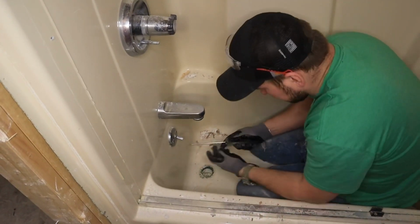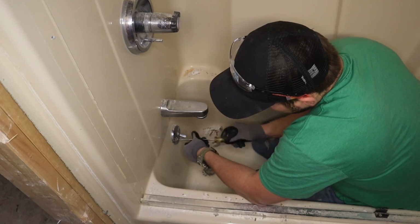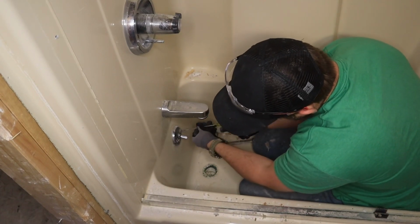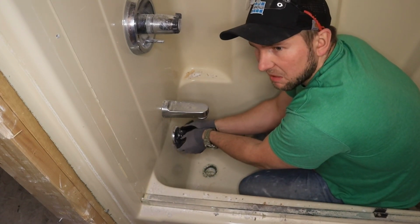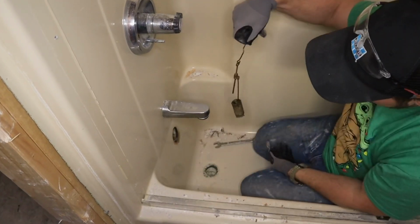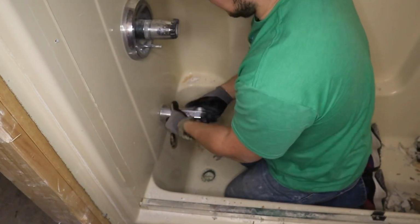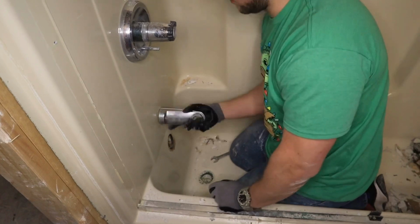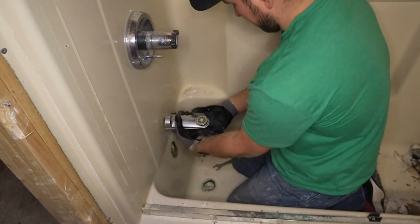Okay, and we have our flathead. This is our overflow trip waste, so that goes here. We can take one of these doohickeys out on this side. Typically it's a pretty nasty thing that you're about to pull out. It's going to have some hair on it, probably dog hair or something. This is the guy that blocks the water that goes there. Use your muscles and just unscrew it. That's how they put these in, they screw in. Some of them might not. There might be a little Allen key here on the bottom, but most of them are just like this. I'm going to screw this one off.